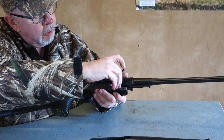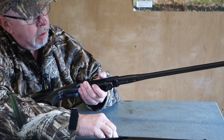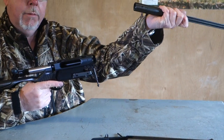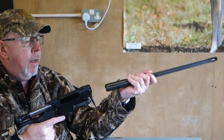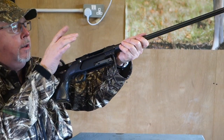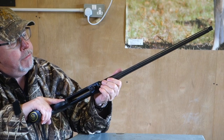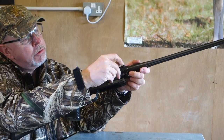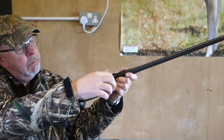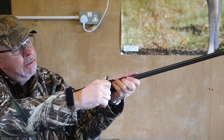So basically, slacken these off just to get rid of the pinch, undo the front one which is a lock, it comes down — that lever there — and the barrel whips out, simple as that. There's a witness key in there as it goes in so the barrel aligns. You put it in and it locks in. Before you shut it up, you close the bolt so the bolt engages and actually grips the barrel where it needs to be. Then you lift this back up and wind down the screws — nip them up tight first, pulling evenly just to get the first little bit of pressure, then go in sequence and give them a good tighten.